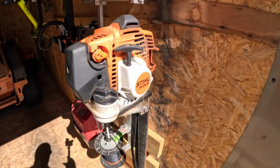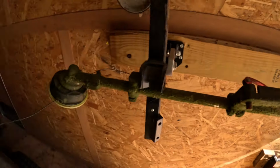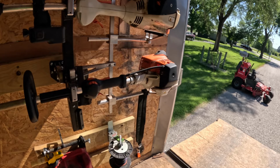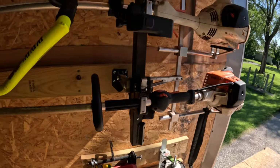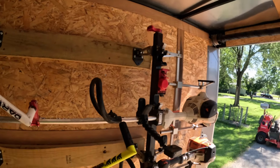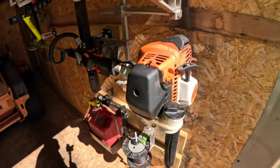Yeah, it's already 10 o'clock in the morning and I can't get this goddamn thing to start, dude. FS94R, dude. It has issues. My other ones had issues too. The 94Rs had issues when they get super hot and in the sun, man. Even on my open trailer, I would have trouble. But Randy's got the 111 or the 110, and that thing fires up constantly. But dude, this 94R never wants to start when it's hot, dude. It's so frustrating.